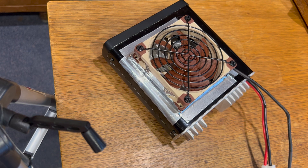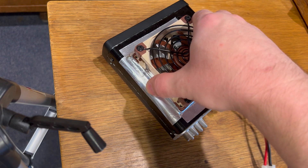I did notice one oddity when running the crossband: I had a CTCSS tone set on the 70 centimeter side so that callers had to send it to open the radio. It turned out that people using the FTM-400 and some other higher-end radios could actually hear the tone because those radios don't filter it out. I couldn't hear it on my 991A but I sure could on my FTM-400. So as of right now I'm running it without tone and just hoping nobody abuses it — which so far they haven't — so all seems well.